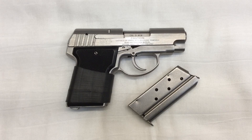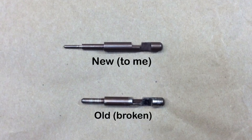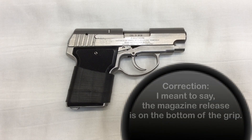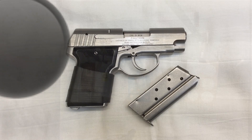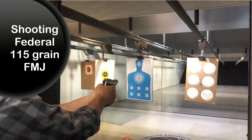I ended up spending $60 on that firing pin, took the pistol to the range, only to find out it also had some extraction issues. I couldn't get through a mag without having to clear a double feed, which — with the mag release being on the grip — can be a task in itself. I ended up getting back online and purchasing a used recoil spring from Sluder Shots, which at the time was the only one available. I also polished the extractor, and between those three things, got this pistol to function 100%.